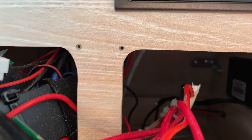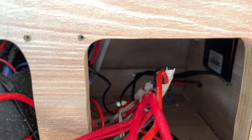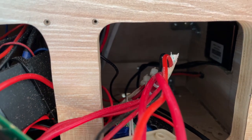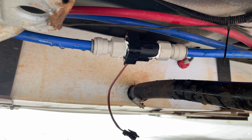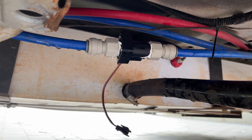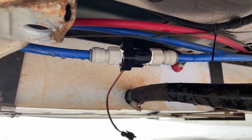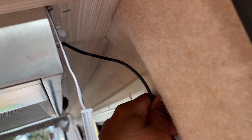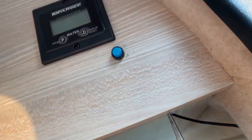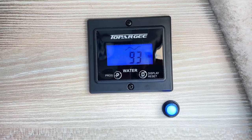Power is really simple — red cable to 12-volt positive and black cable to the negative. Then go back outside and under the van, run the cable together with the extension cables underneath the van, and find a way to get it inside the cabin and up to your display unit. Now that you have that connected, you are ready to go on to the last step, which is the setup.